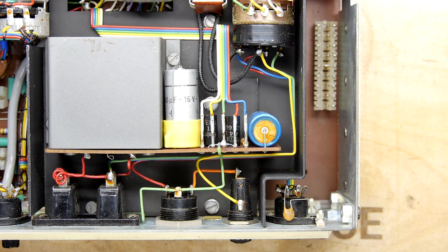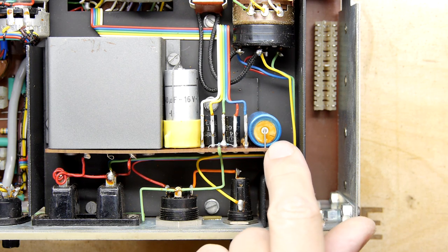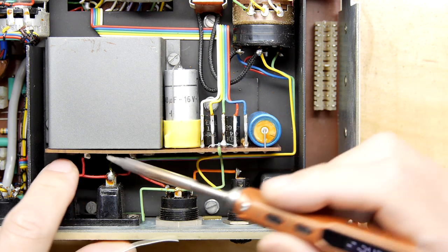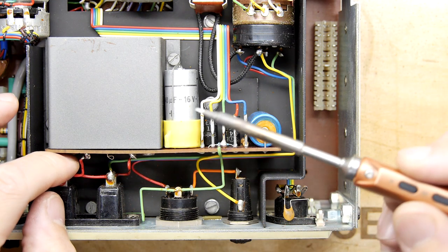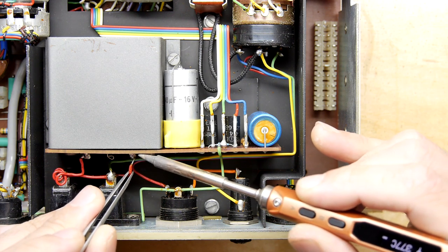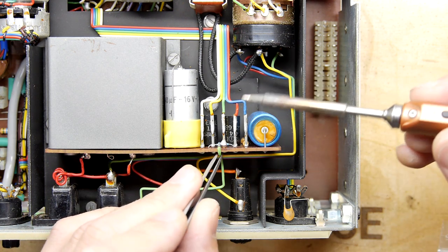Okay, the website does have a manual, but I don't have a login because I'm lazy. I'm sure my father has a login because he would have already got the manual and I can't get hold of him. So what I thought I would do is try to remove this board because I'm pretty sure this board has got this really crackly, crumbly looking capacitor. So it's probably what we need to do because the boards underneath don't actually have that many components on them. As this wire is a bit like that through-hole wire wrap type wire, if I'm very gentle and don't disturb the wiring too much, I'll be able to take the board out and then pop it back in, and all of these wires should hopefully line up to where they came from. That's my logic. We're going to attempt that.